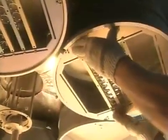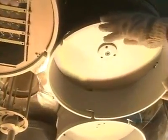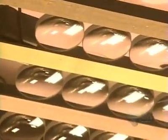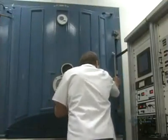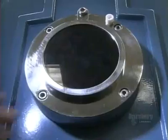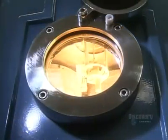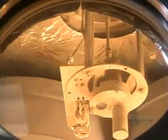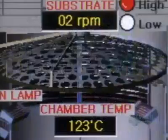Next, they group some lenses on round racks called planets — their universe is a vacuum chamber. The technician closes the door and the planets continue their orbit. Inside this vacuum, an electron beam evaporates coating materials; the vapor rises to give the lenses a protective coat. A computer monitors the rate of evaporation and the coating.